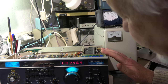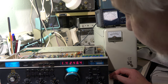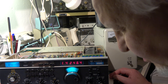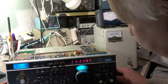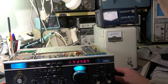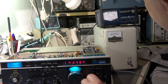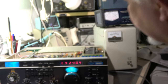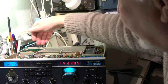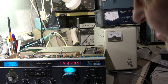I tried to set a compromise but it is not possible on higher bands. Next is the Watt meter calibration. It has to be checked on 14 MHz. The output power is set to 100 Watt and the indication here is also 100 Watt. A little bit too much, I have to reduce it. There are two pots for the forward power and reflected power on the SWR bridge.